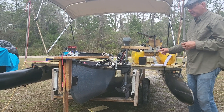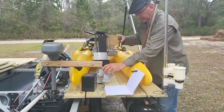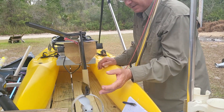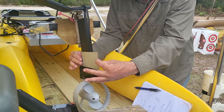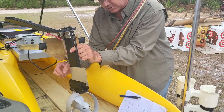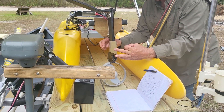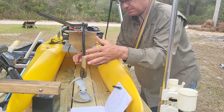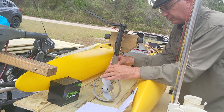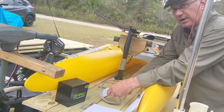Your speed is relegated by the pitch of the prop more so than anything, and the size of the prop — again, because they're made to push heavy boats slowly, not slick lightweight boats quickly. This, on the other hand, is a different thing. This is the Vaquita motor. I have obviously done some home engineering — I made a foil shape where it's in the water so that it's more efficient through the water than it would be if it was just a square or round pole like the trolling motors. Once you get up to five miles per hour it cavitates behind the round pole and makes a little trickle, but with this one, nothing. It just slices through the water like a hot knife through butter. It's also a brushless motor.